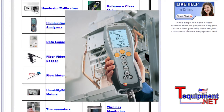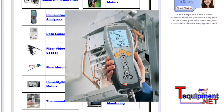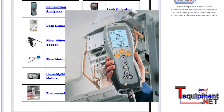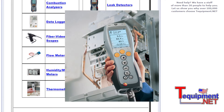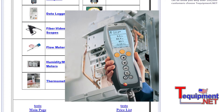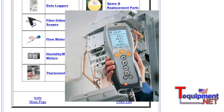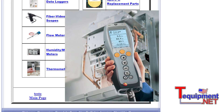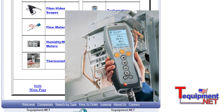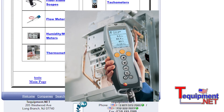The 330-2 would be meant for industrial applications. There is one primary difference, and that is it has a higher-range carbon monoxide sensor. So instead of the two other products, which have a zero to 4,000 ppm CO sensor, the 330-2 has an 8,000 ppm CO sensor. Not only that, it also has a dilution mode, and what that does is once you start getting to the high range of that sensor, it's going to auto-dilute with fresh air so that you can actually get readings up to 30,000 ppm. The big advantage of this is if you're on an industrial boiler or industrial burner and it runs away with CO — CO will kill an electrochemical sensor, and that's the sensor technology of all of these analyzers, electrochemical. Rather than have to go replace that $400 or more sensor, we give you the protection so that you have a safeguard against killing this rather expensive sensor.